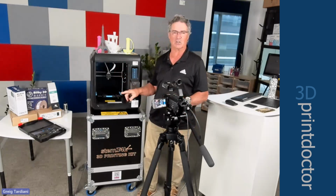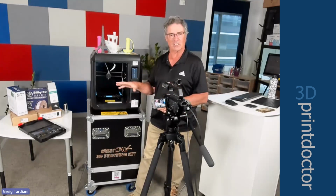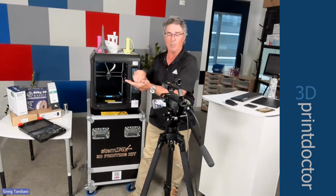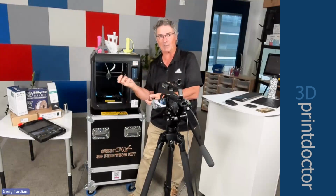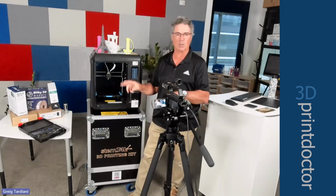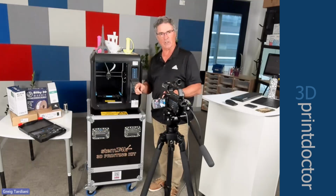So it's a good idea to check when you're doing your 3D prints that it has adhered well. And if you have to leave, then let it go. Most of the time, if it's adhered, you're good. But occasionally it'll snap off and break away. If that happens and you end up with that blob and it's stuck to the nozzle, go through a heat cycle to be able to pry it away, and then go through a full filament changeover and then purge the filament. I'll show you what I mean by purging in a little bit. So we'll do that and I'll give you a bit of an idea of how that works.